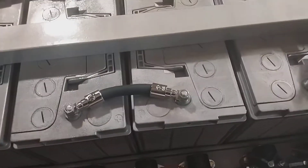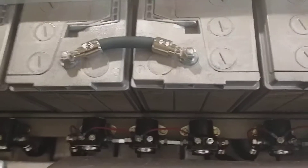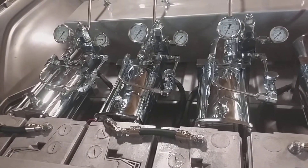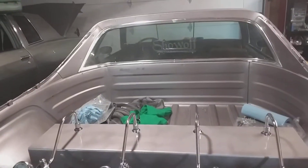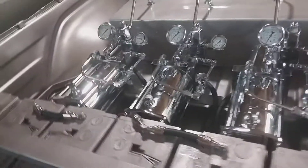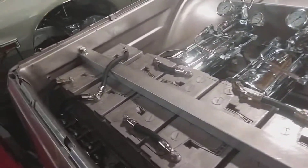The hydraulic system is capable to be designed for 12 volts. So the first thing you usually go are your solenoids — these are the solenoids, designed for 12 volts. Your motors are designed for 12 volts. So if you run in excess to 36, 48, 60 volts, it definitely shortens the life, and that's going to cause fires if you've got poor grounding.